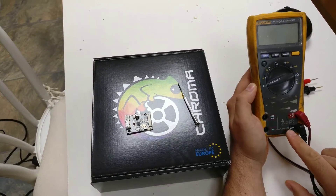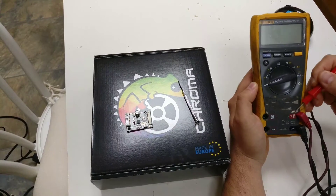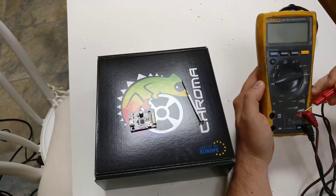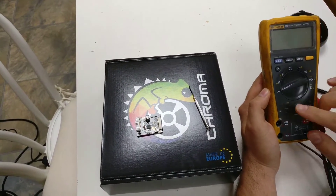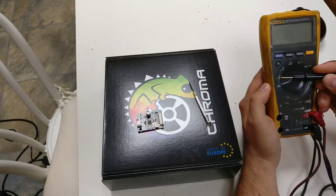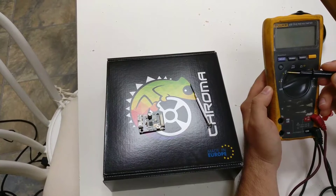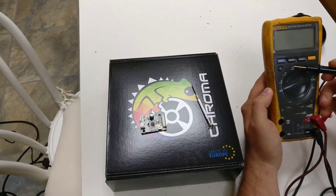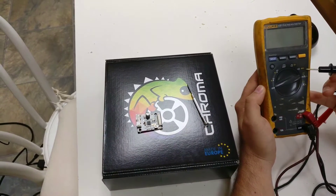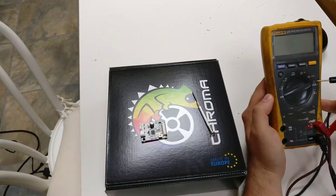With this setup you measure voltages or resistance. As you can see, it'll have an ohm sign or a diode sign, so it can tell you which way round the current would be flowing. The first setting up here is for alternating current voltage, then you have direct current voltage, your millivolts range which puts it into a more sensitive circuit, your ohms, a continuity setting that tells you whether you've got a short circuit, and then the current measurements for both DC and AC.